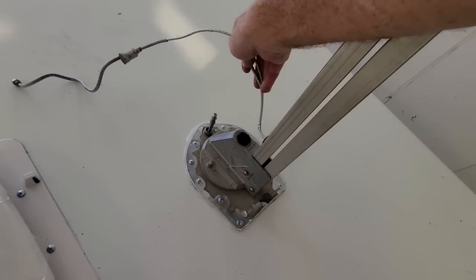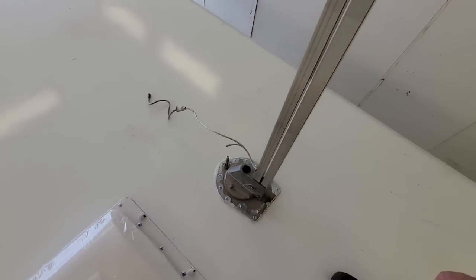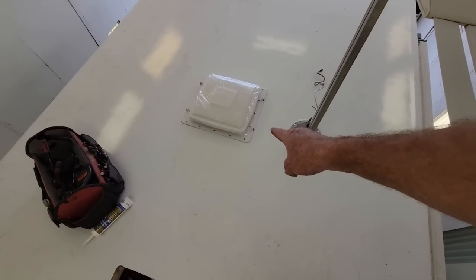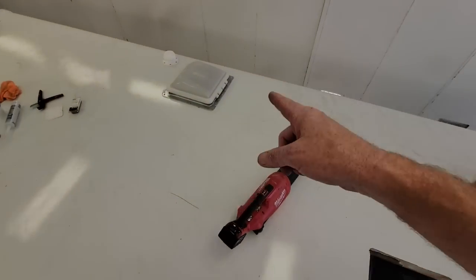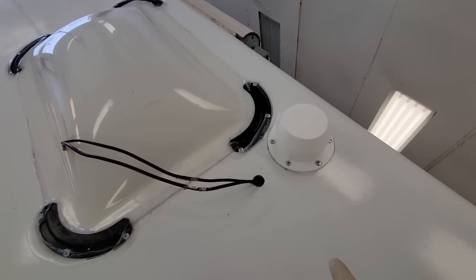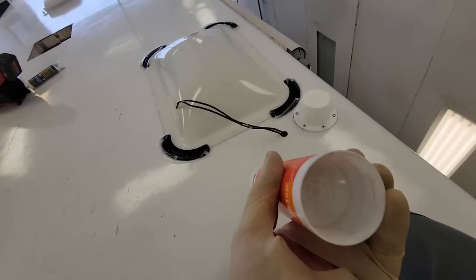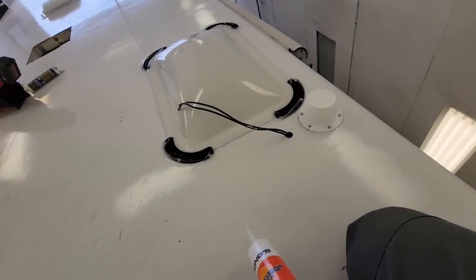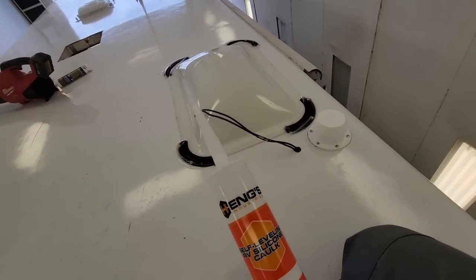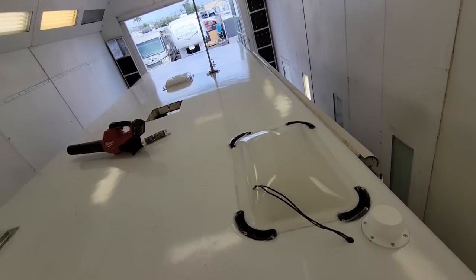I'm going to replace the coax on the TV antenna and get a replacement boot so it doesn't damage our new roof either. But he brought me that vent to put on, and he was just happy with a standard powered vent for the bathroom right there. As, of course, we use silicone as a flange seal, we got to use self-leveling silicone as a lap seal. Remember, this is just redirecting water. It's a liquid flashing. This is not the primary seal. You should not use a lap seal to depend on weatherproofing any vent or opening.